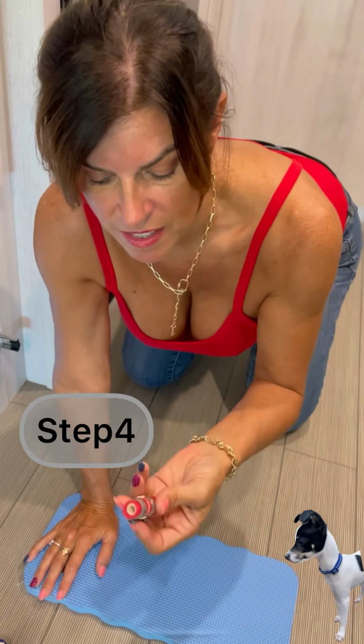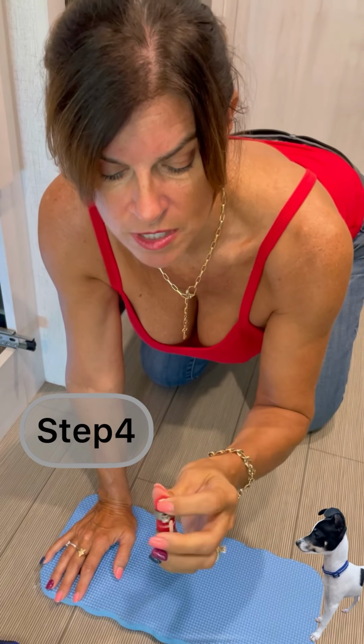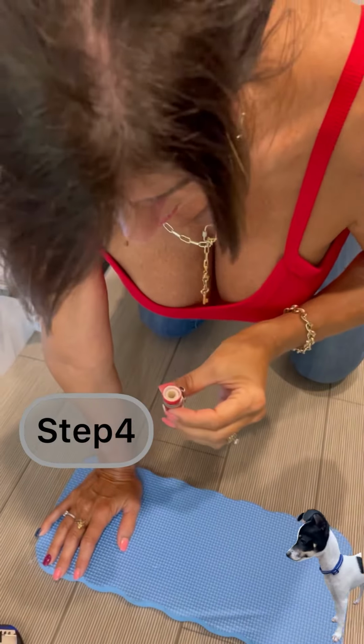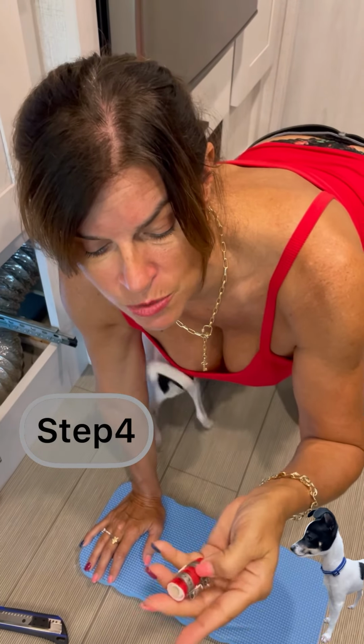All right, the piece that I removed has the connector in the middle and PEX tubing on one side. You can see how thick that PEX tubing is. It snugs right up against your connector. On the other side, I don't know what they used, but it is not PEX tubing because you can actually see that there is space and it is much thinner. There's space in between the connector and the tubing. So that is allowing extra water to flow through, building up into this little connector, and I'm sure it is not a tight seal.